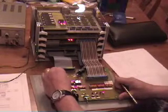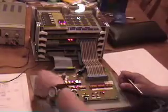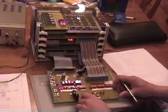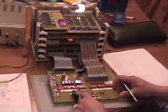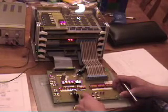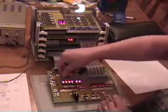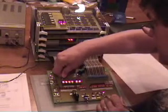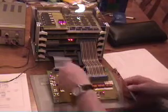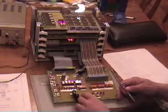And there's 8000 in B. So that didn't exactly work like I'd hoped. But let's go ahead and step anyway, just on the odd chance that my display is not working right. So we'll go back to run and step through — CB is copy SP to A. Actually I should check again, and then 580. I'll go back to stop and look at register A — turn this over to DP, SP, and A. Well, that's interesting: A is zero now. So something is happening, but not the right thing.